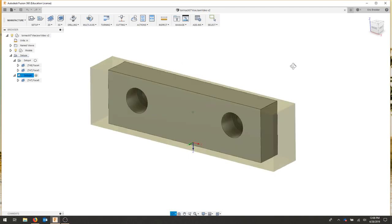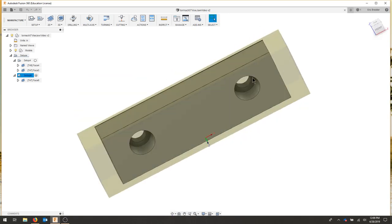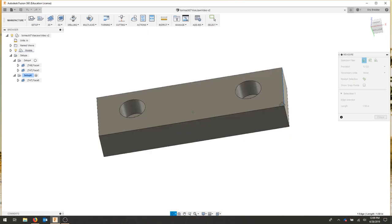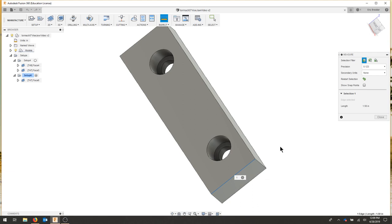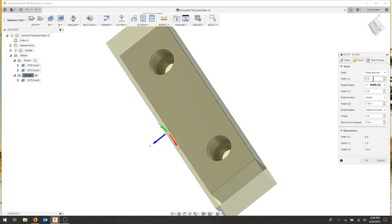We left off facing both sides — the narrower sides of the jaw. We should have a final dimension of 1.5 in this direction, and these should be cleanly faced off with the fly cutter. We're going to move on and look at these faces to complete our jaws. We'll also have to cut our hole material out since our stock is a little bit larger. We used a fixed size box: width of 6, depth of 1, height of 1.6. We took off that 0.1 in order to get to 1.5.